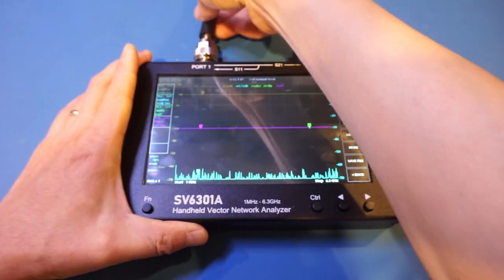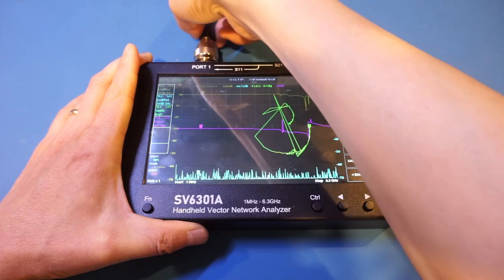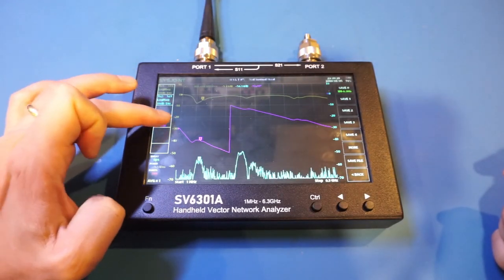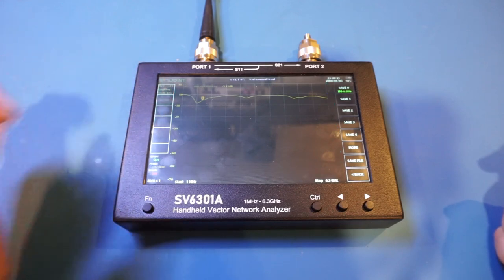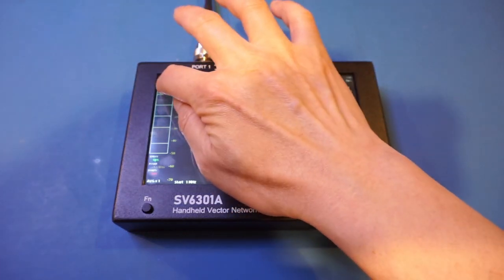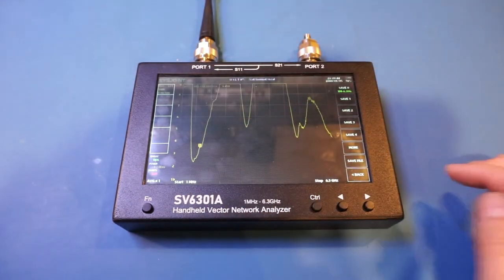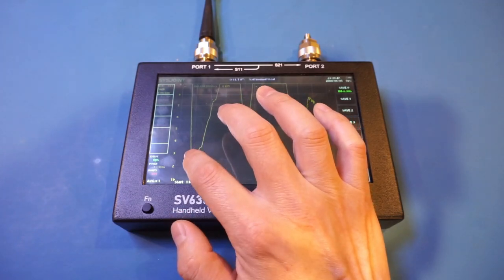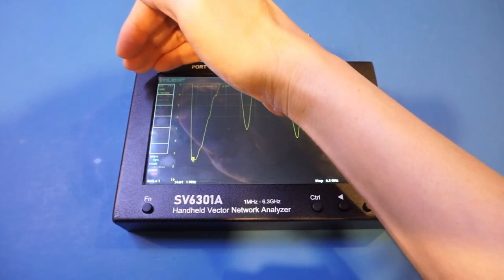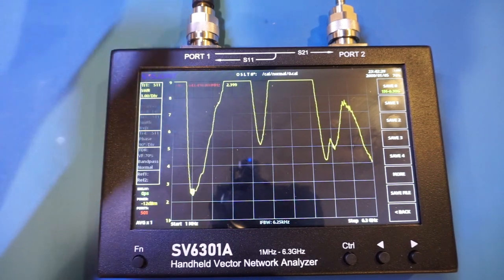So let's take a look. Let's turn off a few charts so we can see it more clearly here, as we don't need the return loss. And you can see we have this dip right here, so let's actually change it to a more familiar display. Let's change format to SWR, and you can see we have this peak, let's just zoom it in here, at roughly 848 MHz. And of course, given this setup, the ground plane is not ideal, so that's why you see the SWR is actually a little bit higher than usual,